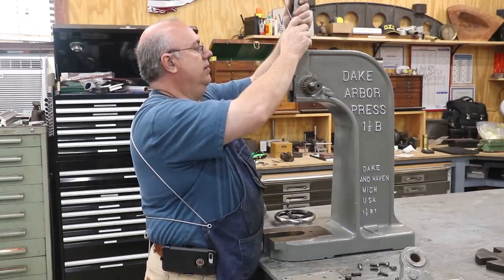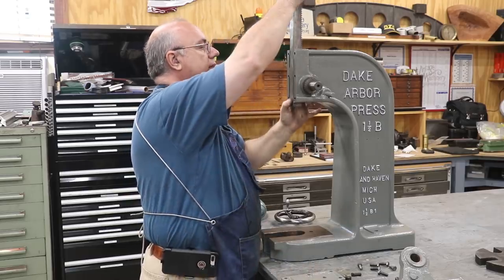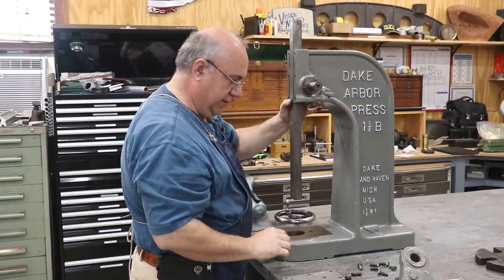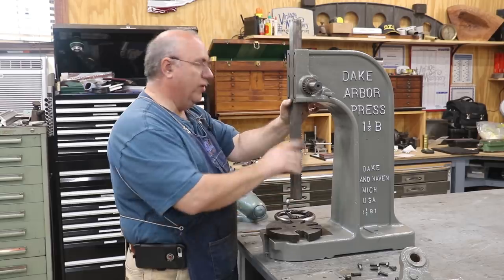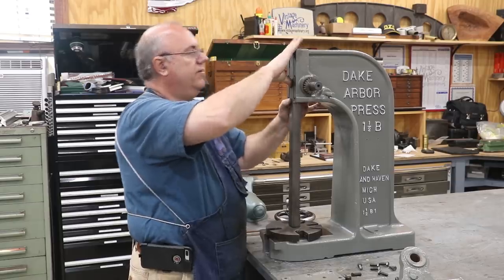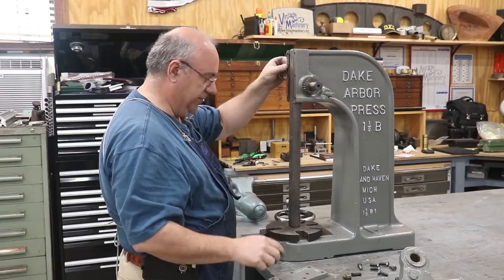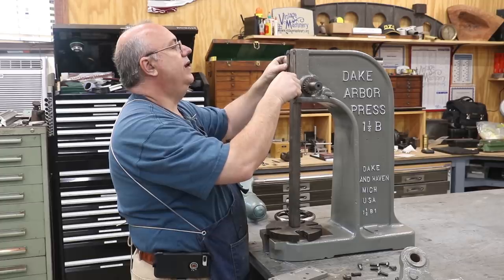Come in here with the Ram. There's a little spring here — this is to just put a little side load on it. There's a set screw that puts pressure on the spring, but I'll just take a screwdriver and kind of get it past the spring coming down through there. I'm going to get it onto that rack and we'll just let it come down. This will at least kind of keep it from falling off. And then we've got our cover that goes on the front, and there were some little spacers back here behind this, so we'll put those back in. It's just some gasket paper — it was actually on both sides.